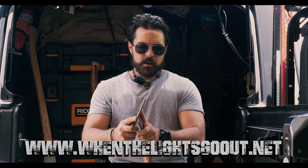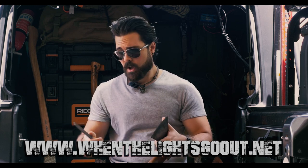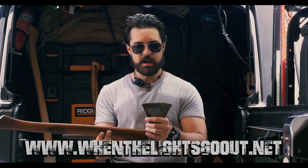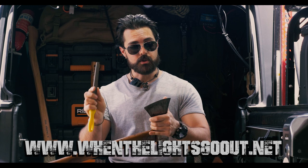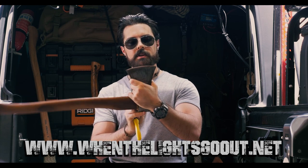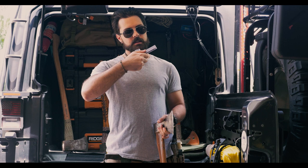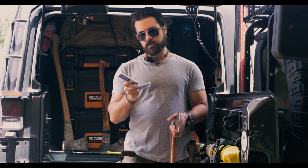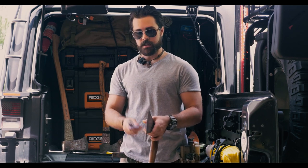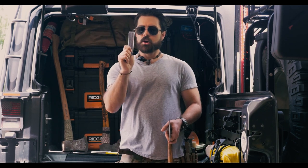Once that burr is removed, it is sharp — real sharp. You don't need to go any further if you want to stay efficient and lightweight — just carry a bastard file in your pack. Be wary though, it removes a large amount of metal. Next step: these DMT diamond sharpeners. I use diamond because I don't like to rub compound on things, I don't like to spit on my stones, I don't like wet stones. Super efficient, easy, simple — carry it in your pack, no water or oil needed.